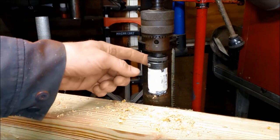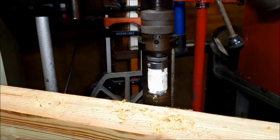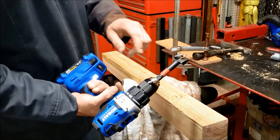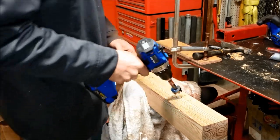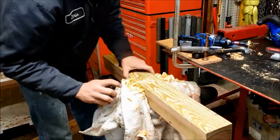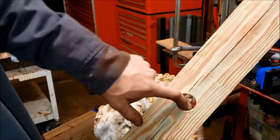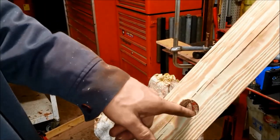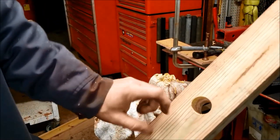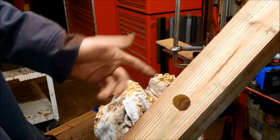I did a few of them with the hole saw straight through to meet on both sides, but it just seems way more time consuming, so I use this auger bit to polish them off. You end up with pretty smooth straight holes, and even if they overlap a little bit it's no big deal because it's centered on both sides.